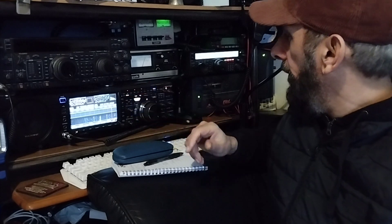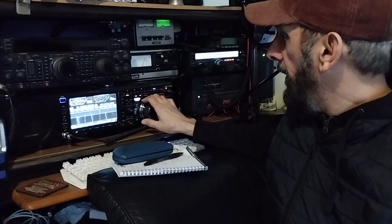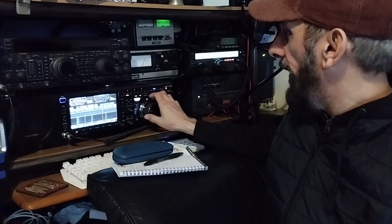So that's the 80-meter side. The difference from flat top: with inverted V this morning, signals much better. Strongest signal coming in from North America — about 5-by-7 on 80 meters this morning. I could hear a few last night — Japan as well, not that strong but could hear them nonetheless. 80-meter noise levels very good, very low — a little bit higher today, about S5. I ended up with an antenna which was perfect for 80 but a little bit higher SWR on the other bands when shortened to get it into the 75-meter portion.